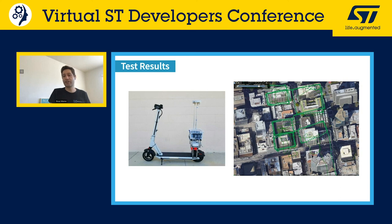One interesting thing is that a lot of DR, for example for automotive, uses map matching. We realized very fast that for scooters, you can't really use map matching, because scooters can ride against traffic, in small alleys, on sidewalks, and not necessarily on the road, which makes it more challenging for the DR if you use map matching. So we're not using map matching.